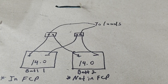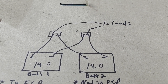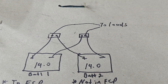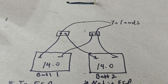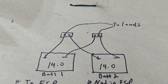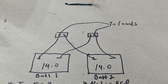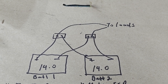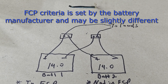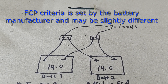Let's run through this to make sense of it. We have a simple drawing to demonstrate. We have two batteries — battery one and battery two — both with full charge protection in their programming and MOSFET-based BMS's. We've charged them above the criteria for full charge protection, which in this case kicks in at 14 volts or above, and when current drops below 3.5 amps.